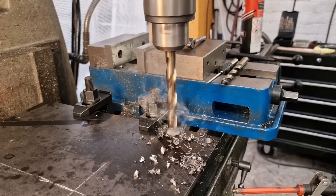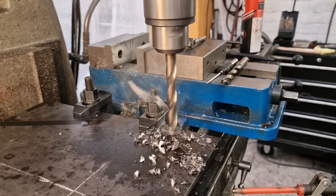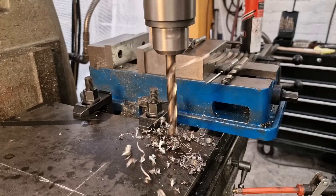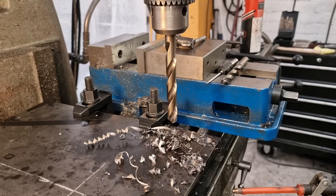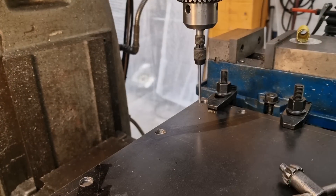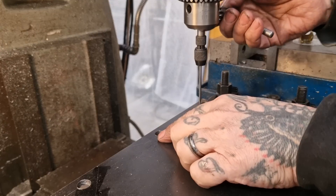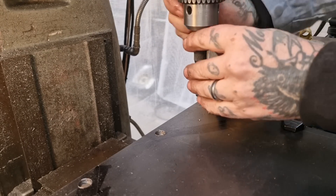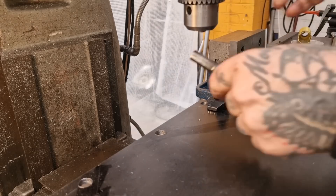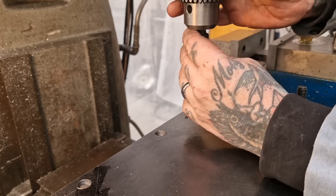There she blows. Not much wrong with that — straight through, 12.5mm. Sorted. So with all the holes drilled everywhere — you can't see, but they're all over it — there's one 12mm and two 10mm holes. What I'm now ready to do is drill the lightening holes.